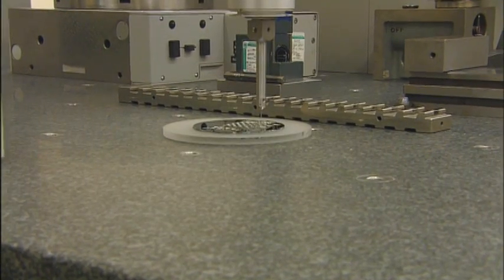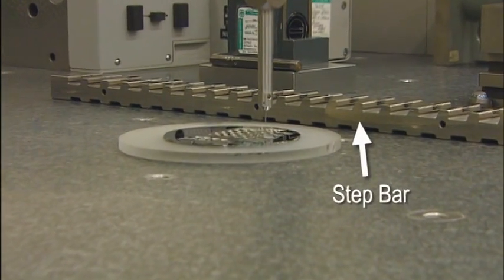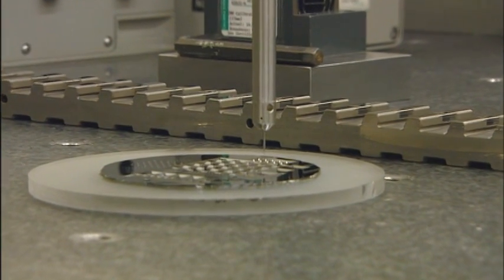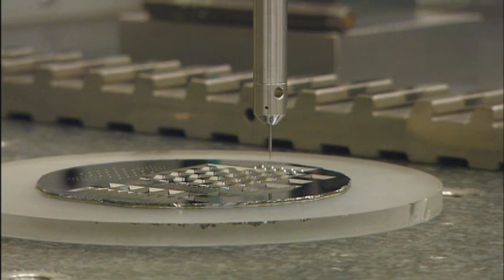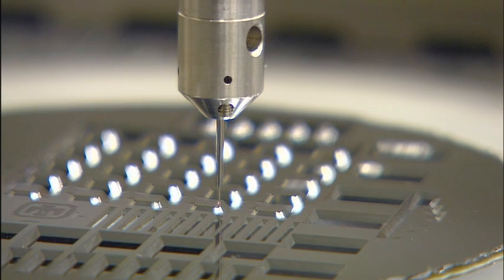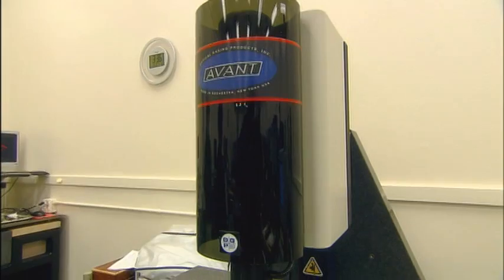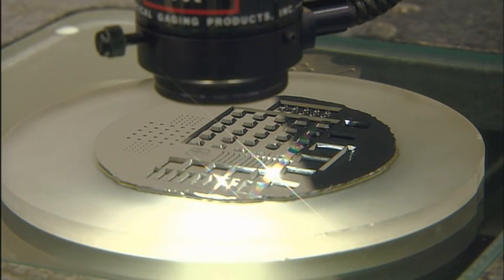Sandia's artifact design was inspired by macro-scale calibration techniques where step bars contain measurement planes at well-defined intervals. At the mesoscale, the team used bulk silicon micromachining, or etching, to fabricate a structure with geometrical features such as sharp edges that can be accurately measured with a touch system. Once the artifact's geometry is certified with a high-accuracy CMM, it can be re-evaluated on a vision machine, allowing more accurate calibration of the optical system.